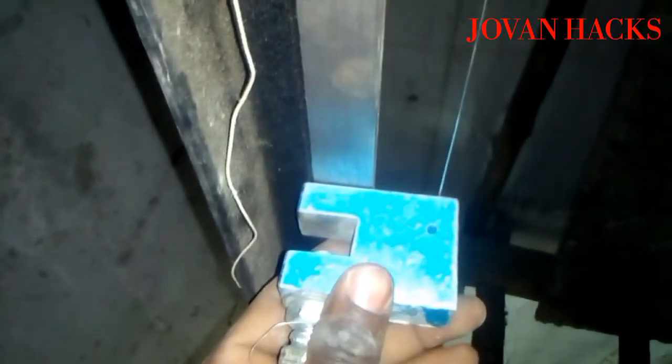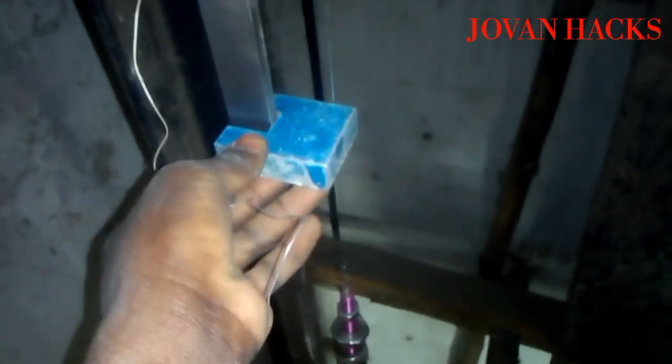After measuring the DBG and setting the topmost bracket, we now use what are called setting blocks. These are called setting blocks — they are holding the 30mm mark. This gap that you have been measuring from the template is called 30mm and it is standard. This setting block will hold our reading all the way from the top to the bottom so the string will not be swinging too much.